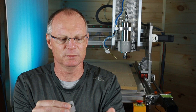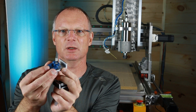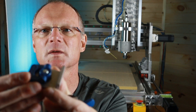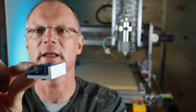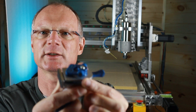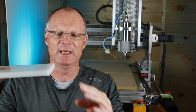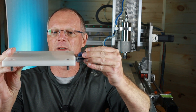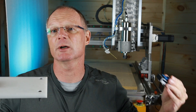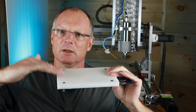Next up is a toe clamp. You will ultimately have a stop block that gets set onto your spoil board, and then a toe clamp is put into your spoil board with a lever action that allows the front piece to move forward and backward. The toe clamp can be a problem if you have larger pieces and you really crank them down on the sides — that side pressure can cause the whole piece to bow upward. So always watch out for that.